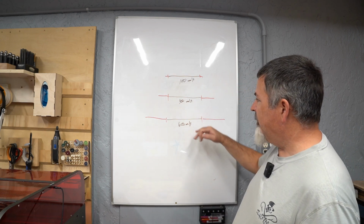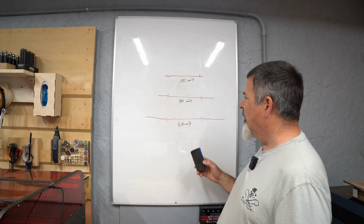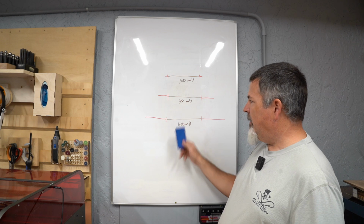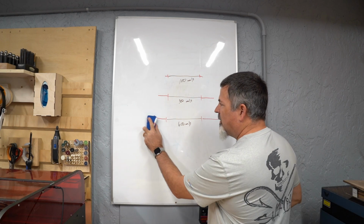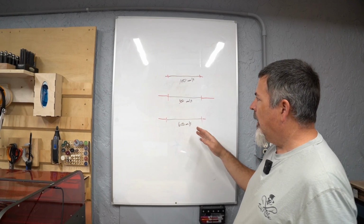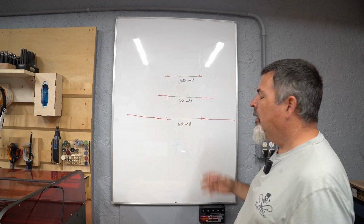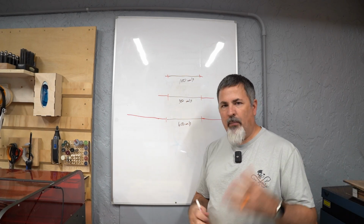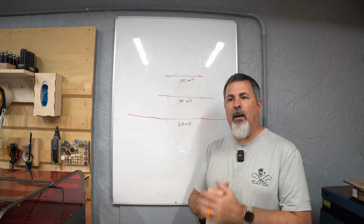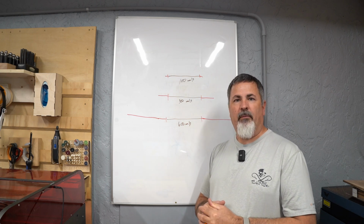That's why, oftentimes you're actually faster to go slower, and learning the fundamentals of what your machine is capable of, and the higher quality machines, again, you might be able to do this because that acceleration time may actually be down here on a really high-end industrial machine. So whereas a $200 diode, it's probably going to be way out here. So play with that, play with your previews, play with those traversal movements and your speeds, and you'll find that sweet spot, and hopefully give you a little bit better burn quality at the same time in your next job.